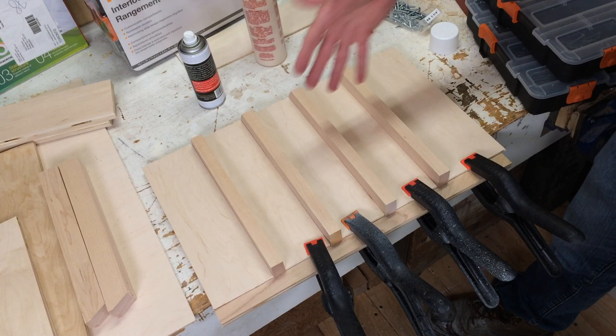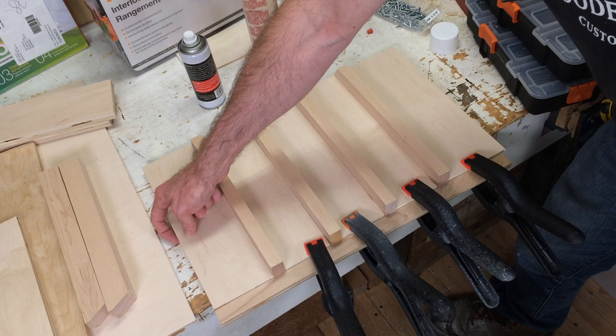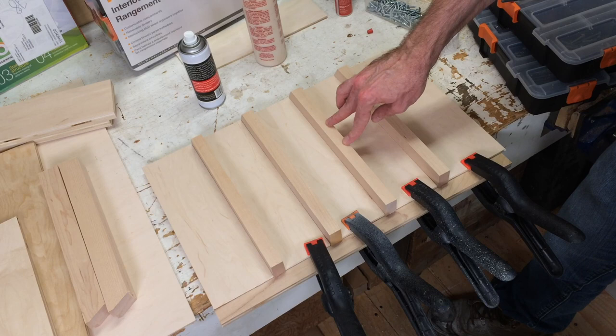This is what's called additive woodworking. Instead of cutting dados and putting these in, what I'm doing is adding half-inch material and quarter-inch material to make the three-quarter-inch depth I need. And it's providing support for these dividers here. It's also giving me a rabbet at the back, so this serves as the surface for the back panel of the cabinet.